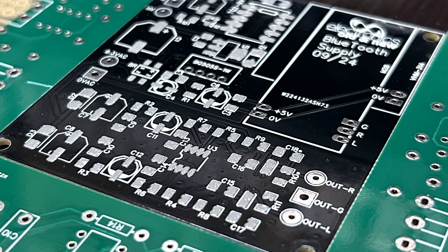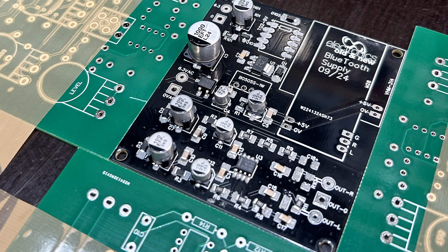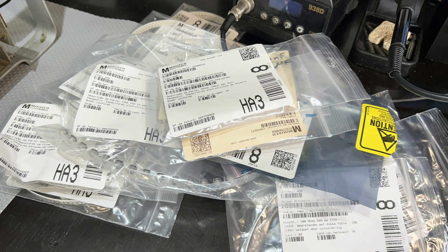It comes out very very fine, and then you just put your components on. It's a bit disconcerting because when you put something like an SMD op amp it looks like all the legs are blobbed together with solder, but that doesn't matter because the capillary action will pull the solder to the pins and you will normally not get any short circuits. One of the most difficult tasks is going through the components — making sure you get the polarities right for diodes and capacitors, placing them one at a time carefully.